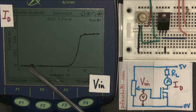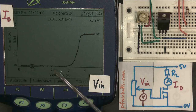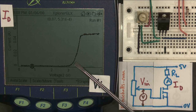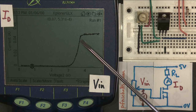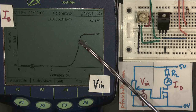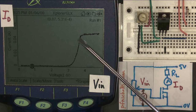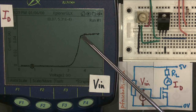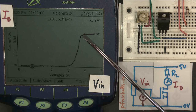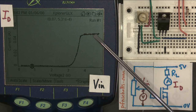This shows us that when the gate-source voltage is less than the threshold voltage, the MOSFET doesn't conduct — the current is 0. When the gate-source voltage is above the threshold voltage, the MOSFET conducts increasingly well. Increasing the gate-source voltage allows the MOSFET to conduct a higher current, as we would expect from the MOSFET equation. Eventually the current would just keep going up if there were no load resistor, but the load resistor limits the current. This is where the MOSFET is acting as a transducer driver, because the voltage across the MOSFET is now 0 and it's dissipating no power — all the voltage is across the load, so the load is getting all the power from the power supply.